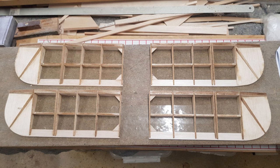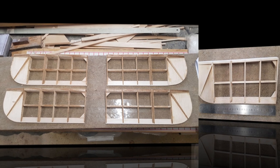Day 2. I made four ailerons this morning. I had finished two for the left wing and was in the process of making a third when I stopped myself and changed it into a right-hand side aileron. Now I just have to sand them to shape and insert the horns. Those decide upper and lower positions.